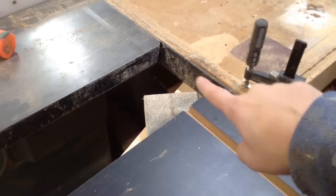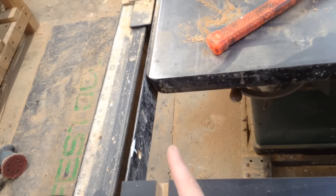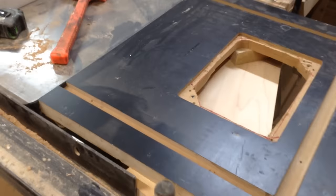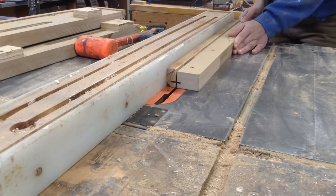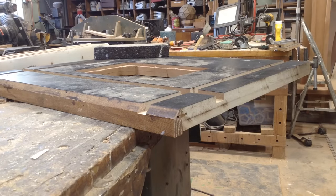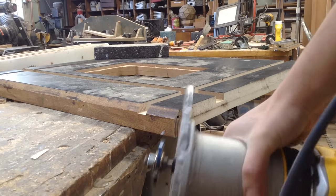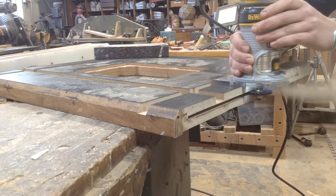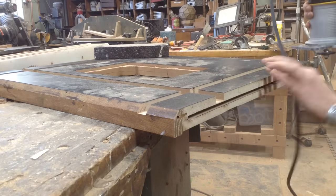This is just a quarter inch and then a half inch MDF laminated together, and then it's skinned with a laminate top. If you don't want to make a full cabinet, you can just make a thick piece of top. If you go and buy a router table top, that's all it is, MDF with a laminate skin on it, and then you can mount it on your wings. You don't need a cabinet above or below it. That would be a basic router table, and you could use the fence from your saw instead of making a router fence. That would be the easiest way to go about doing it. You could do that fairly quickly, especially seeing the cross section to this design.